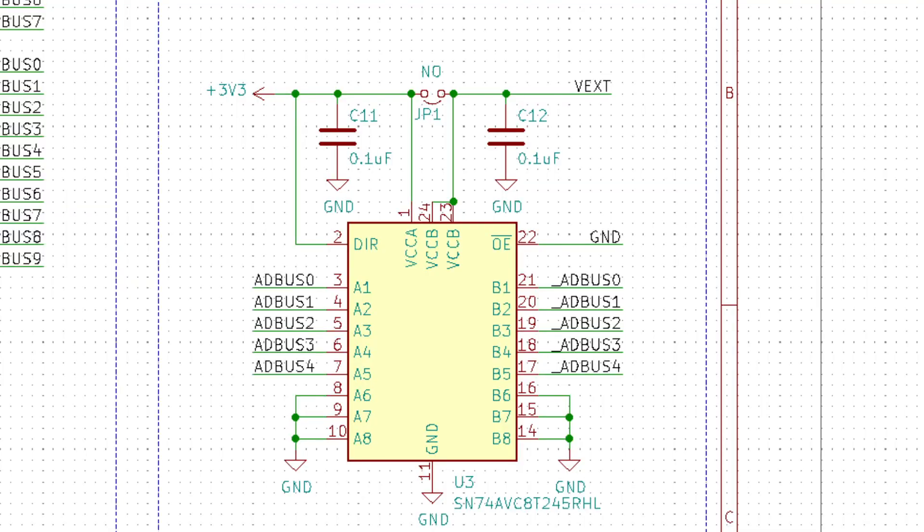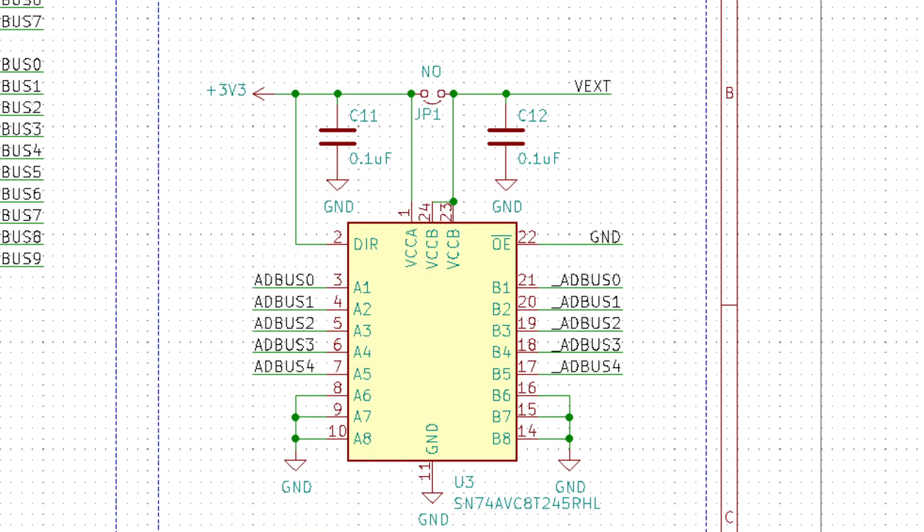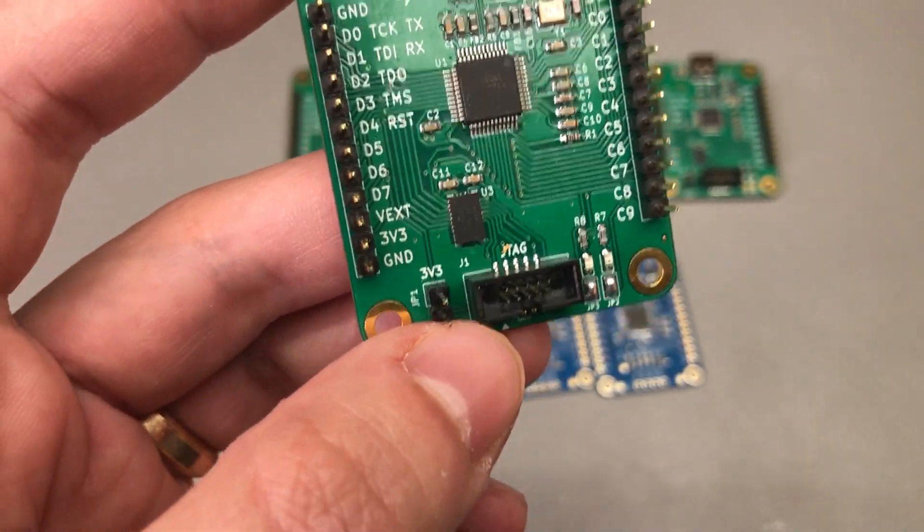Let's take a good look at the schematic of the voltage level translator and see if you can figure out what's wrong. If you know how a JTAG interface works, you know there are typically 5 signals total — 4 in one direction and 1 in the other. With the voltage translator chip I used, there was only one direction pin and it was tied high, meaning all 8 bits were configured in a single direction. It can't function like that for JTAG. This is issue number 2, and unfortunately there is no easy fix — the board simply needs to be redesigned.